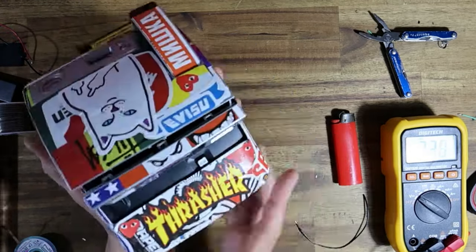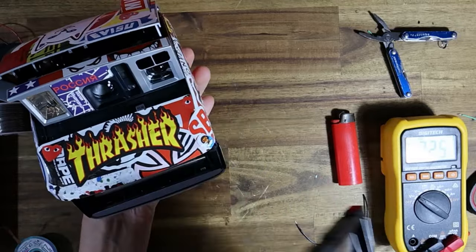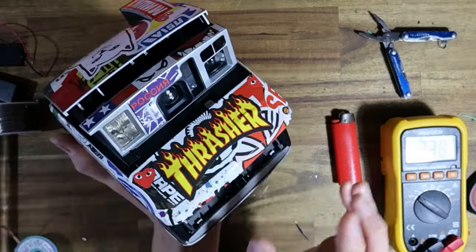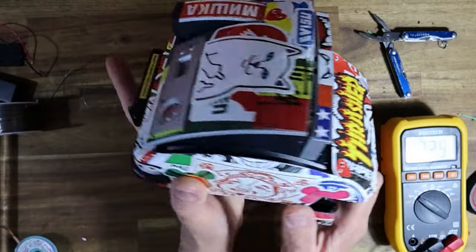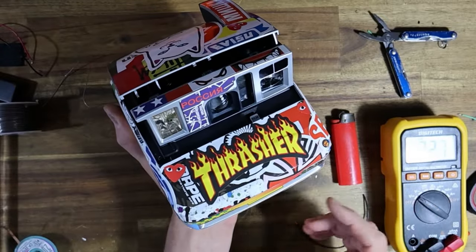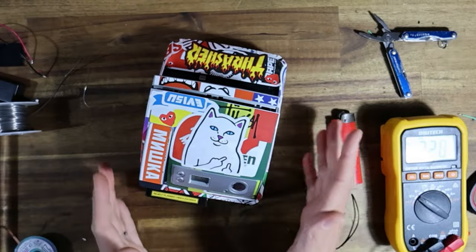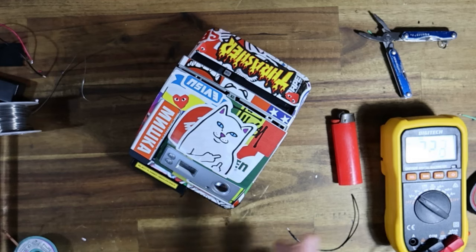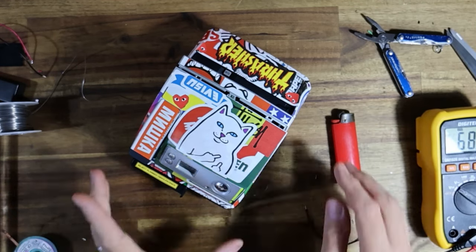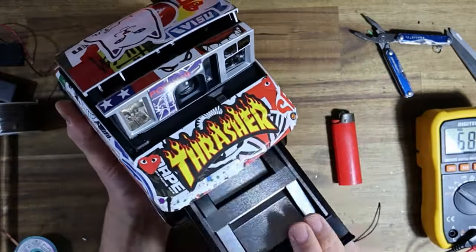Yeah, the only odd thing that I can't figure out is the film eject. I think if you keep the camera like constantly powered, I think what you need to do is insert the pack of film, maybe then power it, then close the door. Yeah, okay. Because that film eject is on a timer, how it receives power dictates how the dark slide eject works. Like, I think if it stays constantly powered, it won't eject the dark slide at all.